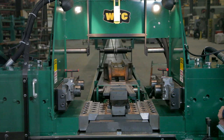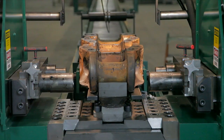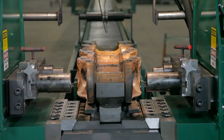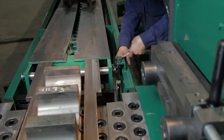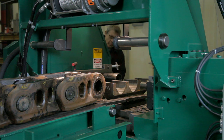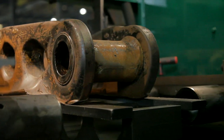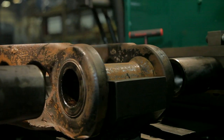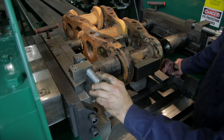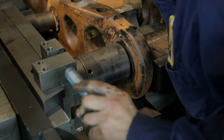To install the saddle, move the indexer's guide arms out of the way. Use an impact wrench to tighten the saddle bolts and then slide the guide arms back so they just clear the upright part of the saddle. Adjust the full up limit stop so the guide arms clear the top of the saddle when the indexer table is completely raised. With the indexer adjusted, finish loading the track chain — raise the indexer table, remembering that both main rams need to be fully backed to do this. Bring the track chain forward until the front bushing is over the front saddle pocket, then lower the indexer table. Slowly advance the left and right rams until the tooling almost touches the track chain and make final adjustments so the tooling aligns with the pin and bushing.